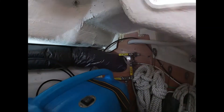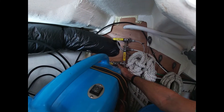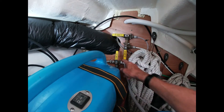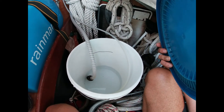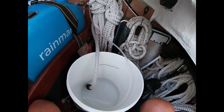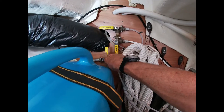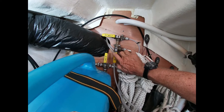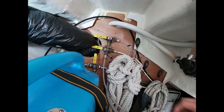Over here are the valves mounted connecting the pressure unit. The bottom valve determines where your source water is going to be. We're going to turn it up — that's for coming from the ocean. If you turn it down, it comes from a pickling jar over here. The importance of this bucket is you fill it up with water you make, which is very clear, and when you're done making water, you take this water and rinse out everything with fresh water. We don't leave salt water in the system because there's too many things growing in it. Right now, valve one is in a position to take water from the sea. Valve two is a test port — your water coming from the water maker comes to this valve.